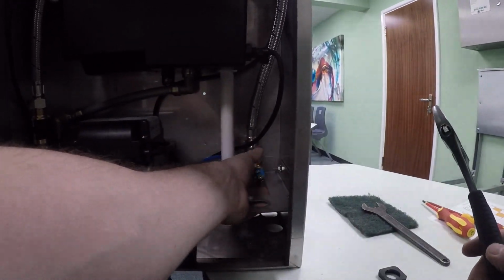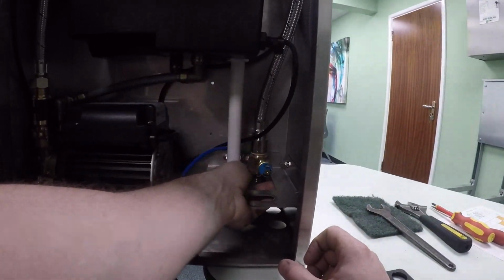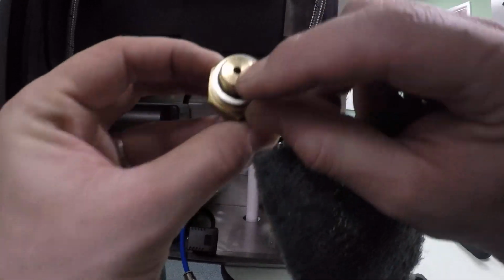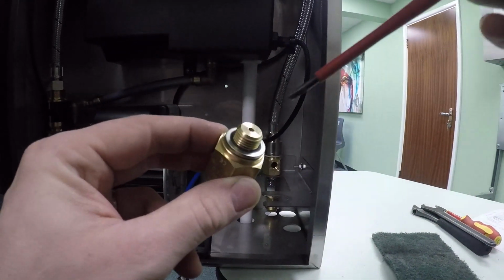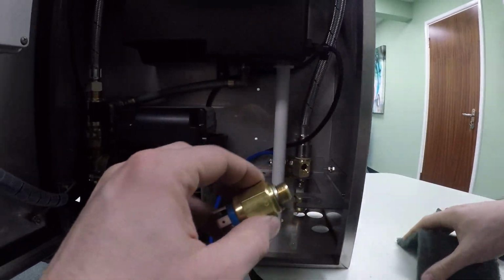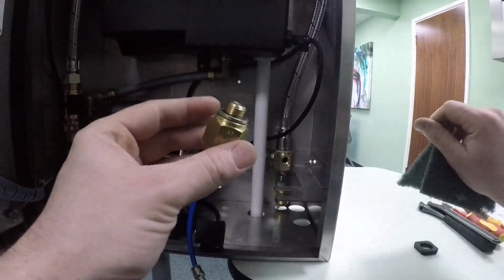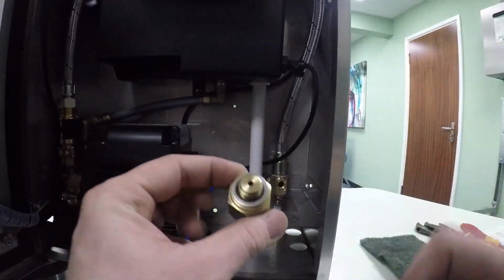Undo the pressure switch. There'll be a little bit of water coming out here, nothing major, because you've already drained the system. So we want to make sure that there's nothing inside here blocking it off. Get yourself a little screwdriver, poke it out if there is anything in there, bring it out, give it a wash under the tap, and just make sure there's nothing around there. Most of all, we're going to make sure that is clear.